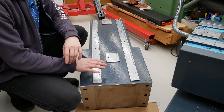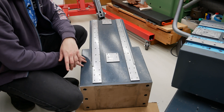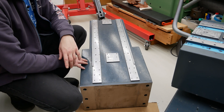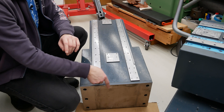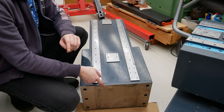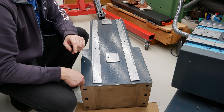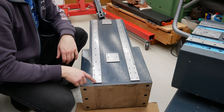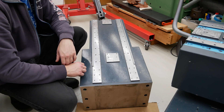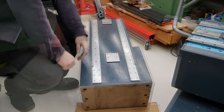Before I put the column on the base, I want to mount the linear rails because it's just easier like that, and I can also easily measure if everything went right with the mounting. Here you can also see why I used the angle grinder in the last video — on the base I made a little relief cut in the middle, which made it easier to scrape the surfaces on the two sides, since the column only rests on those two sections. That saved a lot of time. So let's mount the rails finally.